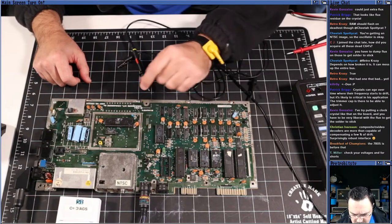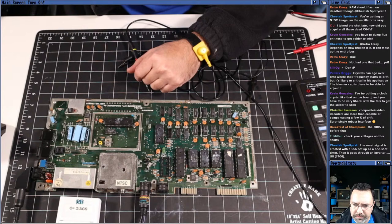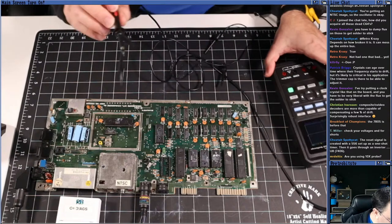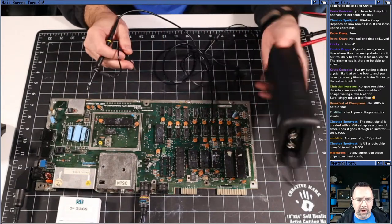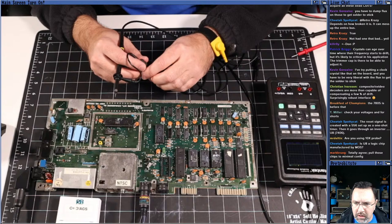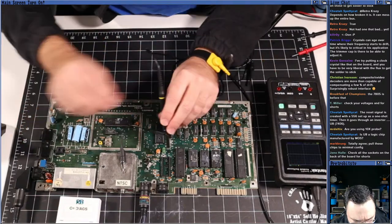but, oh, okay, 8701 is a MOS chip here, right? Reset signal is created with a 556 setup and goes to an inverter U8-7406. No, this is a, yeah, this is a 10X probe. No, I have it in 10X. Oh, you know what? Maybe when I connected this thing to the software, the PC software changed the probe settings. Yeah, maybe you're right. Maybe I had the probe in 10X and the software changed. It was in 10X before, but maybe not now.